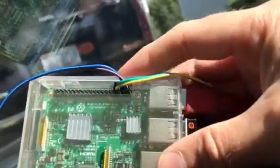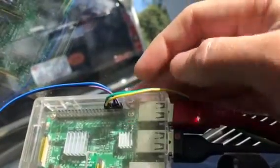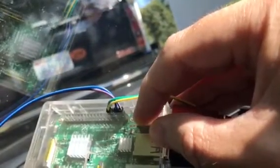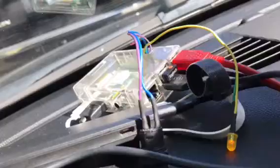I've changed the pinout to the logging trigger and the LED. This is more friendly to the 5-inch LCD if you add it. The switch is on the very bottom corner — I think that's pins 37 and 39, then you skip two up and this is the LED. The LED gets triggered by the Python script whenever the logging switch is enabled. This is a latching switch, so up is not logging. The light goes off; press it down, it detects it and starts logging.